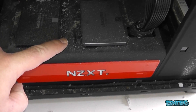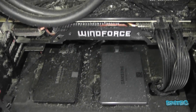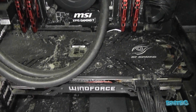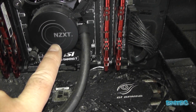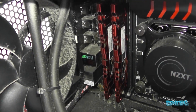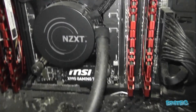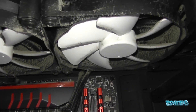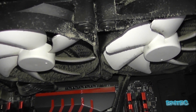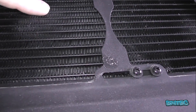You can see the dust build-up inside — if I get really close you can see it's pretty nasty. You may also want to change the thermal compound on your CPU and GPU if it's overheating. The temperatures believe it or not are still pretty good on this machine even though it's clogged with dust. Look at the fans up there where the radiator is — the radiator is clean at the top but underneath where it's drawing air in it's blocked.